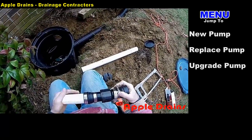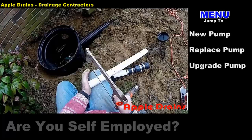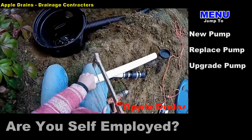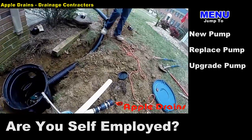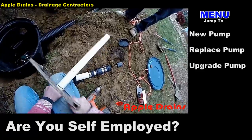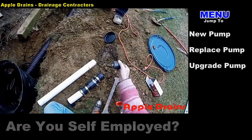Tighten up the no-hubs — these are just clamps. Next I'm going to cut a small riser coming from the check valve where we'll put a 90, and it will come out through the middle of the pit. A good hacksaw is a real plus when you're doing work with PVC. Make sure you have a good sharp blade and you can cut right through this stuff.